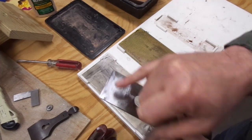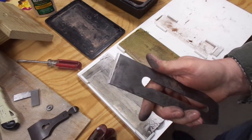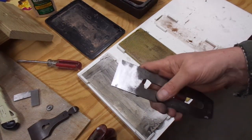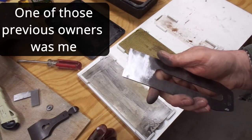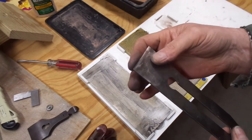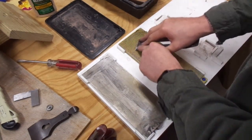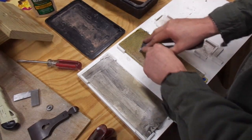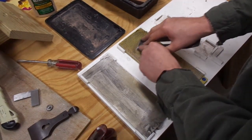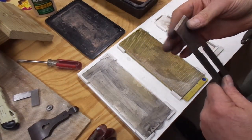There's a hollow over here that I couldn't get out, and a little bit over there that I couldn't get out. So once again I found an iron that's very old, and I didn't have the good fortune that some previous owner had taken the time to flatten the back. But it's starting to feel a bit of a burr here, so I think we can get this ready. I'm not too concerned with the primary bevel at this juncture — looks like there's still a remnant of a hollow grind in there, and it looks on the order of 25 degrees.